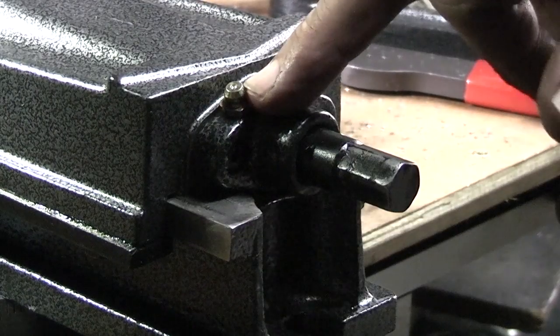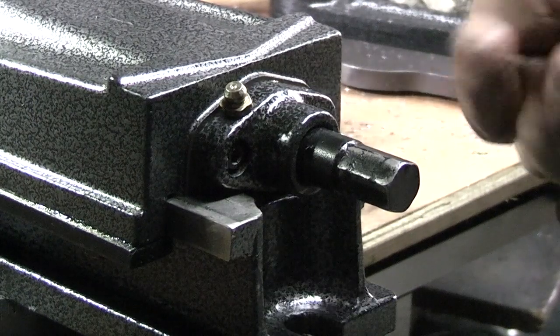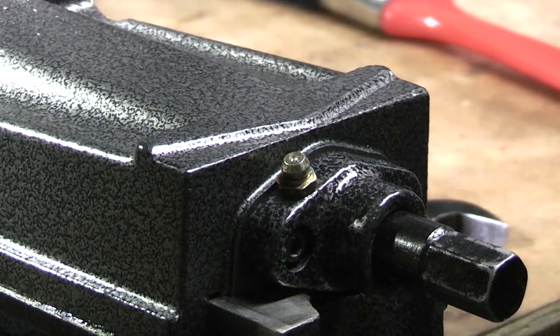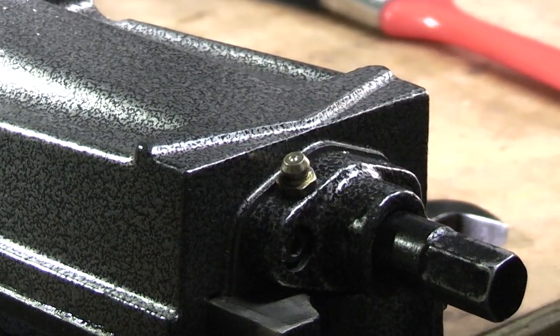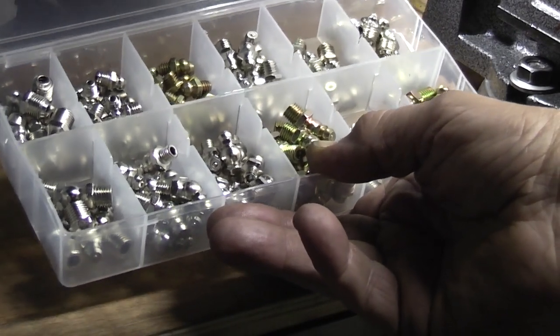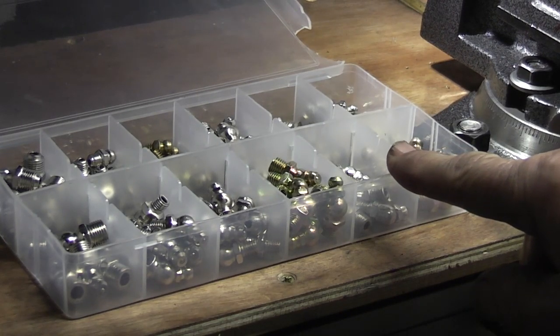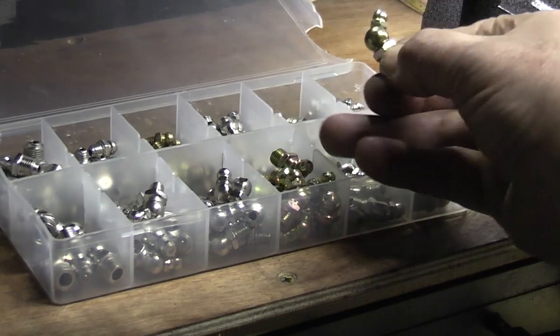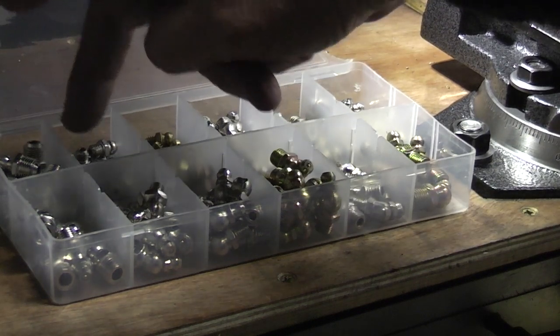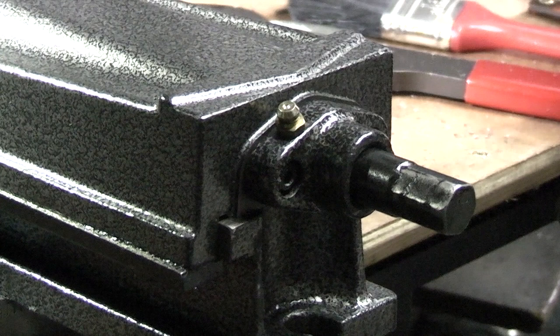That's done — so we've added a grease nipple here to lubricate this part, and a grease nipple which you can get from underneath to lubricate the main thread. If you look under there in the mirror you can see the grease nipple for the main screw, and the other one is just on the top so I can get the grease gun under here to grease that and the top one without having to take the vice off the milling machine. The grease nipples cost £12 but that was a set of 130 grease nipples for £12 in different sizes from eBay — these are all angled at 45 degrees on the bottom and the top ones are all straight. They're a mixture of metric and UNF. Well, that's it for today — I hope you liked it, hope you found it useful, and we'll see you next time on Inups Engineering.